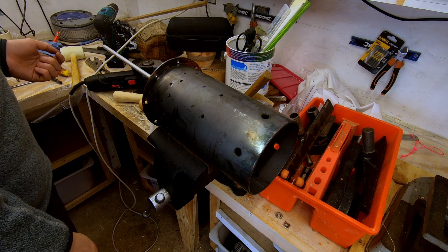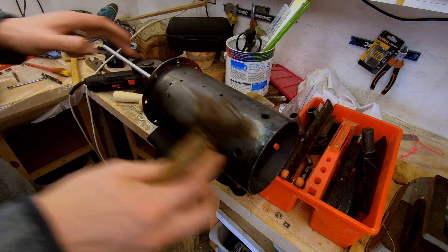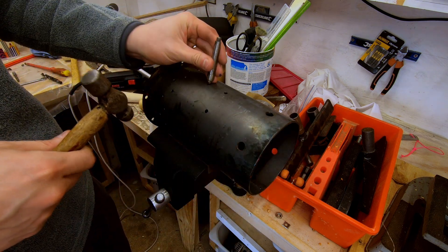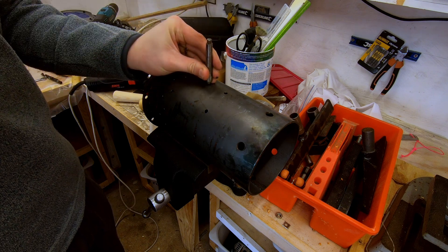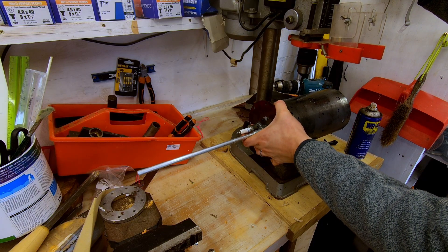At this point my only theory for the resonant running was that there was not enough air flow through the combustion chamber and it was flowing back out the compressor side. So I drilled extra holes in each section of the flame tube.